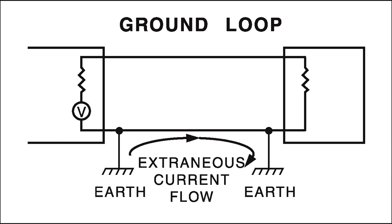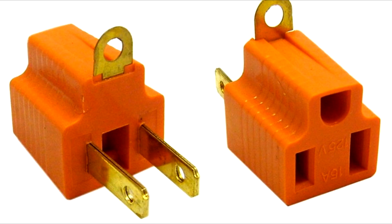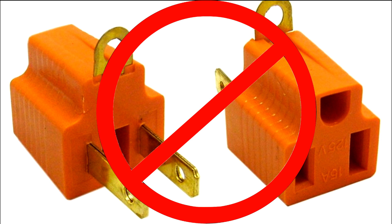How do you break it? Some guys would just use one of those ground lift adapters at the power cable of one of the amps, which converts it from three prongs to two. But that's not really a good idea — that's not safe. That's a dangerous method because if something should happen to that amplifier when it's ungrounded, it's going to damage the next thing in line or maybe even give you an electrical shock. Do you really want to go down that road and find out what happens?